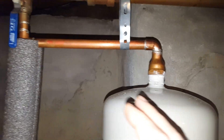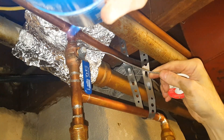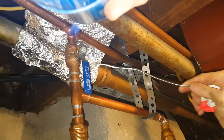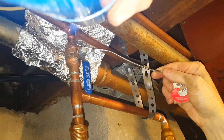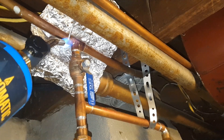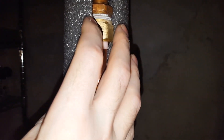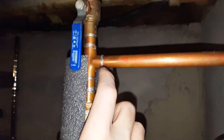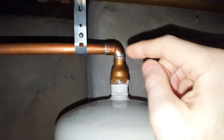So if you don't have this, then you would cut a spot here and put the unions on it. Preferably you would take the flex off if you have flex, because you don't want any heat going down into these parts that can melt — so you don't want to solder right connected to that. This is three quarter going down to half inch. In my situation I have half inch pipes here, but I have a part with the three quarter female thread that's going down to half inch. You could also go to three quarter inch, whatever your system has. And then you just install that.